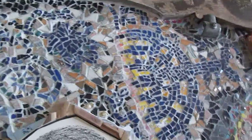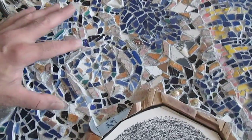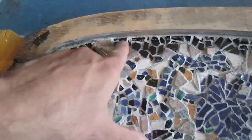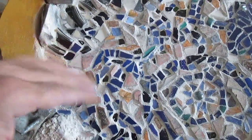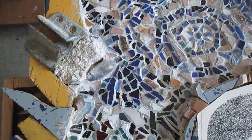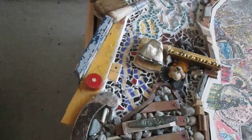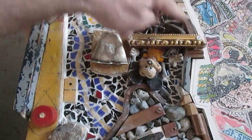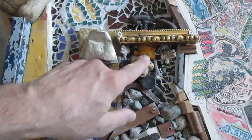I do have to go over it — there are a lot of white specks of grout on some dozens of tiles. I also have to go through inch by inch and make sure there aren't any little cracks or crevices between tiles; those will need to be filled in with grout. The last thing I did was grout this section here and this section here yesterday, and cleaned it today.